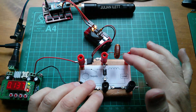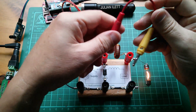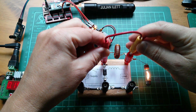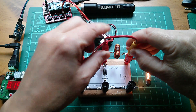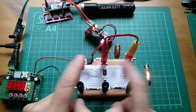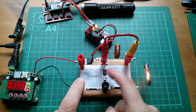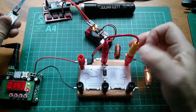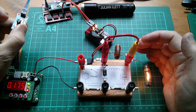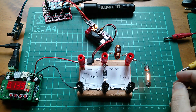The other way I can take the buck converter components out of circuit is just to short out the inductor with this little link wire. Now, if I do that, you'll notice that the bulb gets a little bit brighter. I'm not entirely sure why that is. The diode, of course, if there's no inductive component in here, doesn't do anything, because the positive side of the circuit is never going to go more negative than the negative side. So this diode is effectively now useless. And with the inductor shorted out, this works just as a pure pulse width modulator — I can vary brightness like that. But with the inductor back in circuit, is it working as a buck converter?